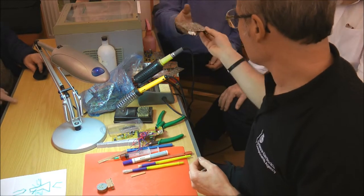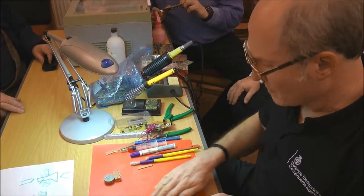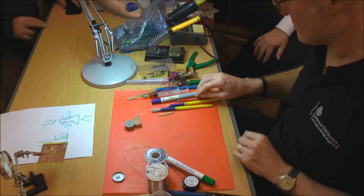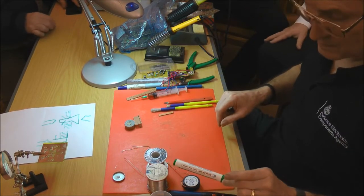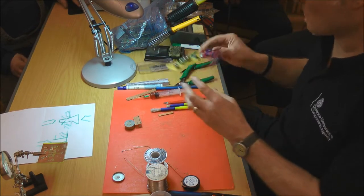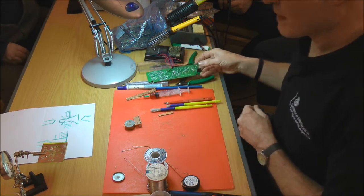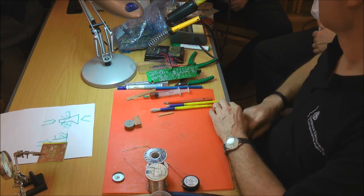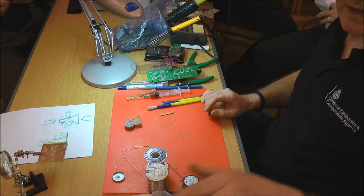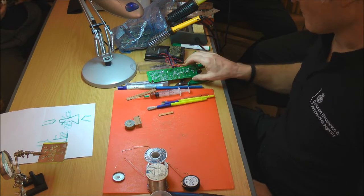Years ago, didn't you put wax on boards and then put them in acid baths? Does that sound right? That's it, for etching. Do you do that anymore? Some people might. I wouldn't know. I can remember they did wax on the board, actually resist paint. You drop it into ferric chloride, and it etches the copper away, and you wash it. And then you've got a circuit. People still do that. I did one about 12 months ago. You wouldn't do something that was very, very fine with something like that, would you? That's been done with ferric chloride. I just can't get my mind around those surface mount components.